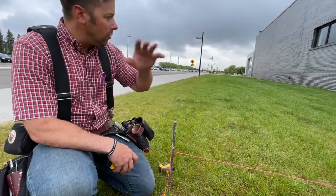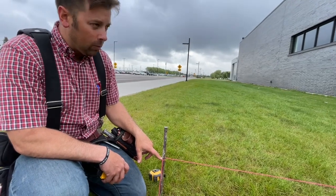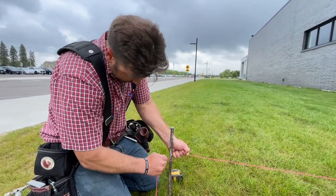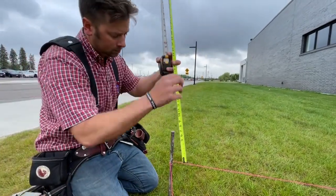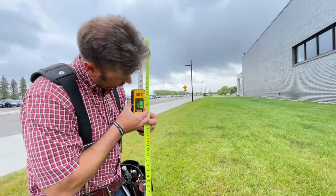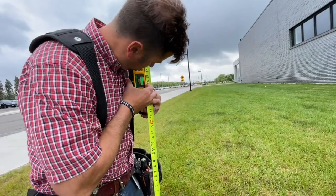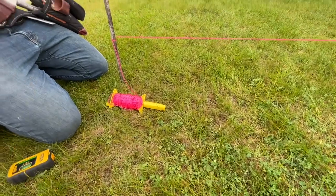We're just going to put a level line on here, and that's what your practice will be. We were three-eighths of an inch low, so we're going to move up three-eighths. I'll let my mason's knot slip up three-eighths of an inch. That's close — that's within an eighth. So we have a level line right now.